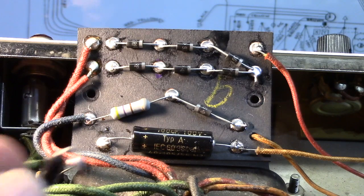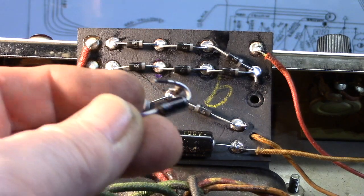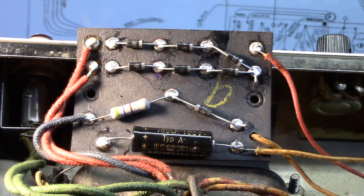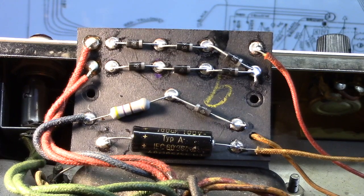the one that got replaced in here, this one, was the one that was the odd man out. That is a 1N5408, which is a 3 amp 1000 volt diode. That's hideously large, folks. The problem you run into when you get that big, that can actually run into damage issues. I mean, the fuse is going to blow first, obviously, but what if it doesn't?